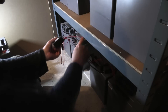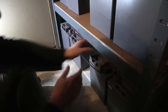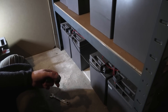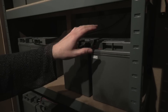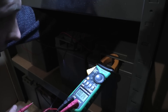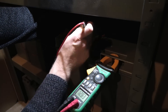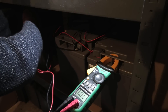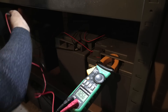The other one I was able to hear had a whining sound - this one is very quiet. Now it will be working on making sure the batteries don't get out of balance. Bank two was a little bit worse - this one was 13 volts, this one was 12, and this one was 11 volts in the same bank, which is not great. Now the equalizer has been connected and the first battery measures 12.8, next one 12.6, and over on the other side we have 12.5 and 12.5.